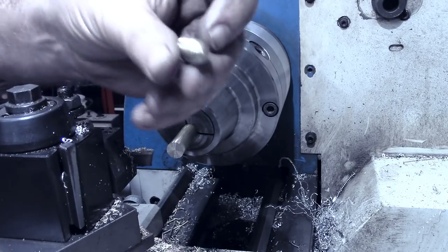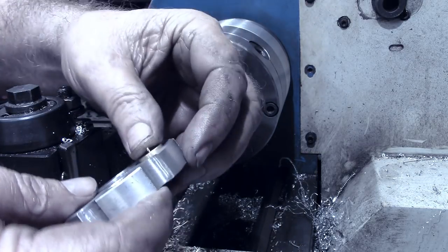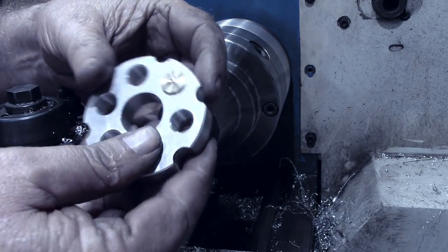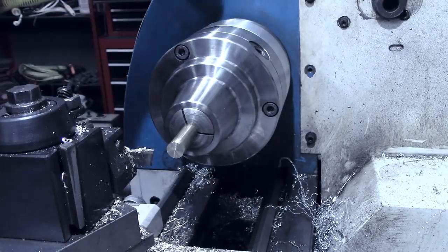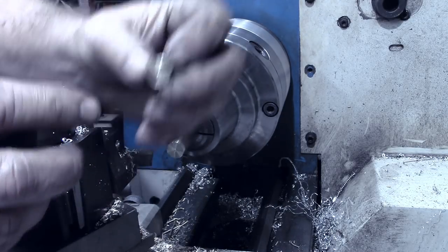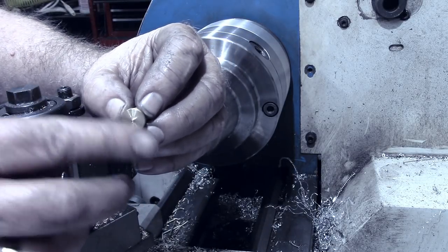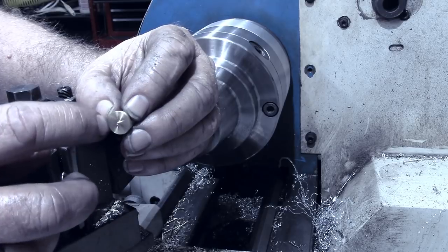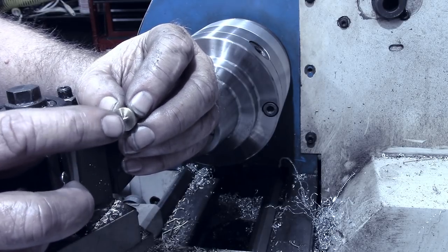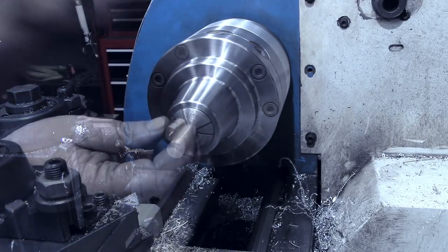Okay, and there we have the filler for one of these. It will go in that side. Shoulder on the other side. Now, just like we did with Naomi's, we'll put this back into the 7/16 collet and turn that in. And instead of putting a ring around there like we did for the buttons, this will have just a small internal ring in there for the primer.